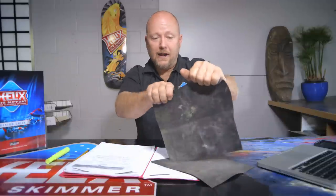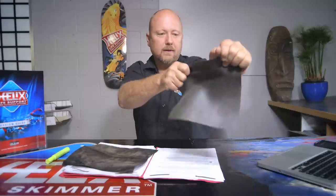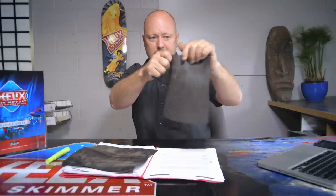Stretchability — the RPE doesn't stretch at all, not one single bit. The EPDM stretches quite a bit. If you need to save 30% on a small backyard ornamental pond and want to go with the RPE, go for it — just remember you're going to have a longer installation time. For my construction team, the 30% savings isn't worth it because we can move so much faster and more efficiently with the EPDM, and I can make the shapes more precisely.